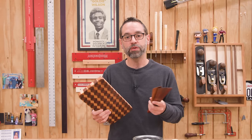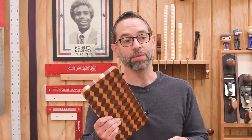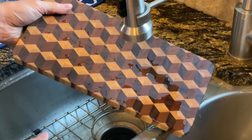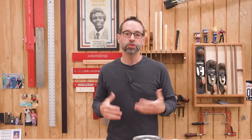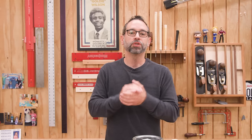Let's take a step back and talk about what we're actually looking for out of food safe finishes. Primarily water resistance. If you're putting meat, vegetables, or anything wet onto these surfaces, or using spatulas for stir frying, you just don't want them absorbing liquids. These things don't have to be completely sealed, but the more they resist water and other juices, the less we have to deal with the wood getting rough and gross with repeated use. Excessive absorption can make kitchen items look bad, smell bad, and shortens their life. But there's another factor — maintenance. A finish that resists moisture for one meal but then requires reapplication is a big pain.